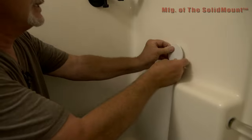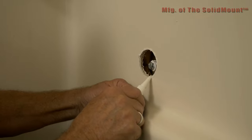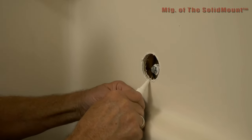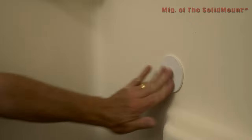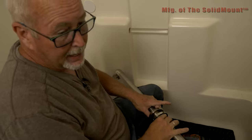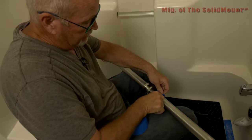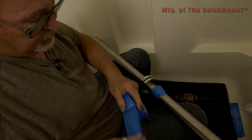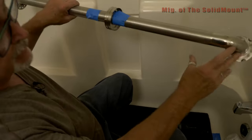This just goes ahead and screws on. We're going to take some caulking and put it around the opening here, and we'll seal it. Remember we also put a bead of caulking around the outside — so it's completely sealed all the way around. Go ahead and screw this in and turn it as far as you can; once it stops, it stops. Now I'm going to show you a little cheat on how to keep the set screws out of your way. If you just take some blue tape, wad up a little bit on the end, wrap it there, and do the same on the other side — they can't slide past it, so as you're working they won't get in your way.